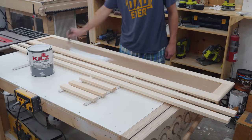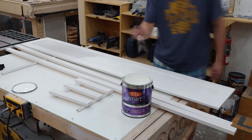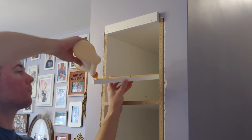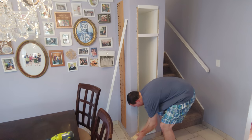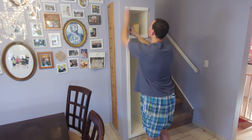I then gave the door and face frame pieces a coat of primer and followed that up with two coats of white melamine paint. I start the face frame assembly by applying glue along the back and driving three two inch brad nails to the three horizontal pieces. I can then apply glue along the vertical pieces of melamine and drive in a whack of two inch nails to forever make this its home.